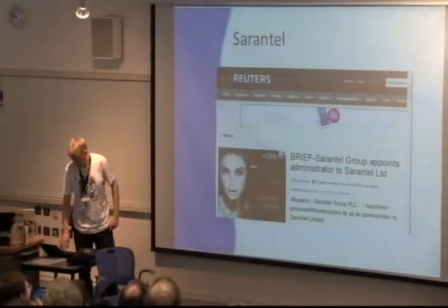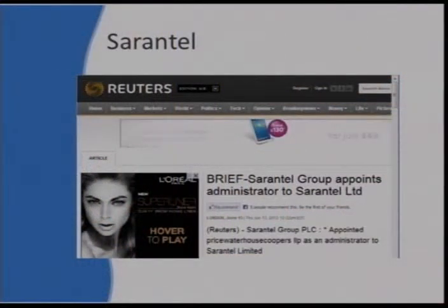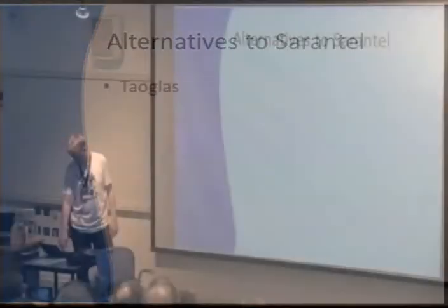Sarantel, that sums it up. Unfortunately, Sarantel, which is the other product that's been around from day dot, great antennas for GPS modules, have gone bust. Can't get any more. So if you are designing printed circuit boards with Sarantel antennas on, there will be no more at the moment. I'm sure at some point somebody will buy the IP for it and start remaking them. But at the moment there's nothing on the market. It's a bit of a shame really, because they're passive antennas, but they actively reject interference because of the design, and they do work almost in a 360 pattern.